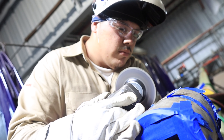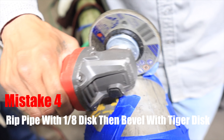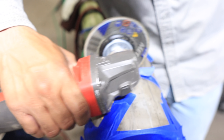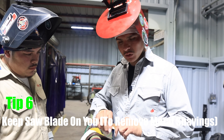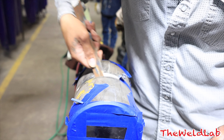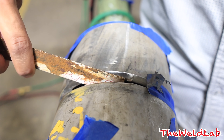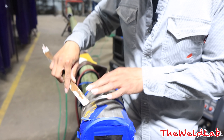I'm watching him grind and there's a better way. What he's doing is just going at the walls, but the best thing to do is just slide and rip it first, then do the walls. Just slide it in there, open that gap, then build it back up. A good tool to have is a blade — whenever you go to test, if you mess up and have to rip it, just hit the inside and take all the metal shavings out. It's a nice little tool, I keep one on me at work all the time. You can see there's a little metal shaving right here — you don't want that in there because it will fail you on your root.